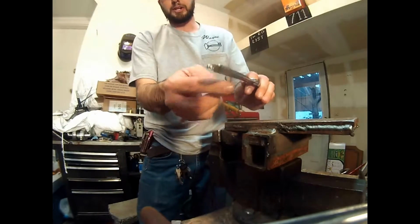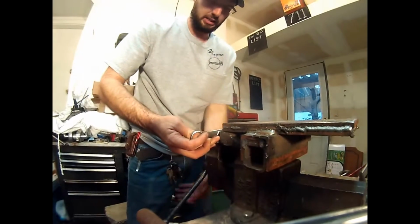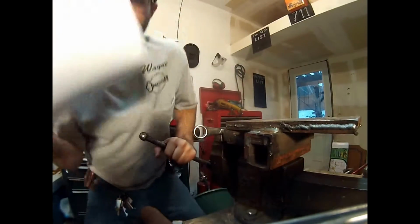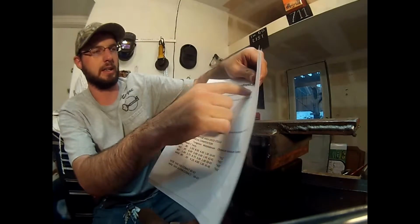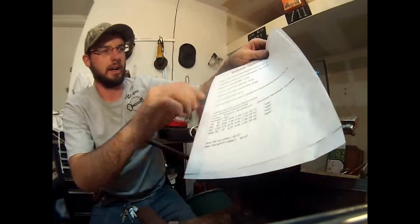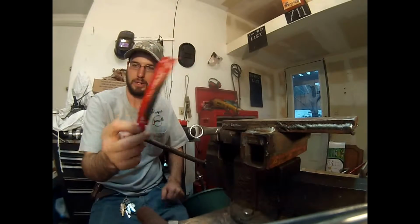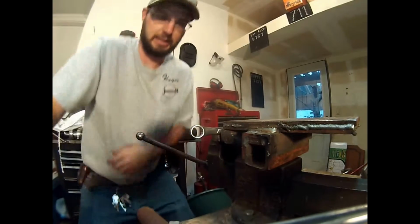Since we're starting to get to a little thicker piece of steel, I'm going to go ahead and switch this around so we can keep everything fair and even. Now again, we're going to be doing tool steel, high-grade tool steel. We already cut this softer steel with the blade already, 3/4 inch right here. This is going to be your higher grade tool steel, 54 to 58 Rockwell hardness scale. So far, these have cut this steel, but they are pretty much trash by the time they're done because the teeth are just about filed off of there.